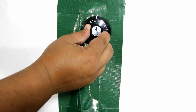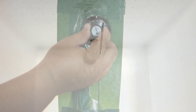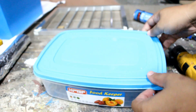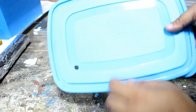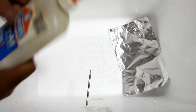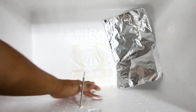Now let us test our thermostat to confirm it can control the light bulb. To stabilize the temperature inside our incubator, we will place a plastic food container filled with water to serve as thermal mass. To relieve the pressure of the fluid heating inside our plastic container, we will drill a hole on its lid. If you want to use this container to control humidity inside the incubator, you can add more holes on the lid. To insulate our polystyrene from the heat of our incandescent bulb, we will use white glue to stick aluminum foil on our polystyrene walls.